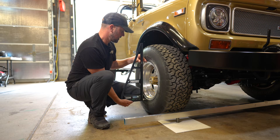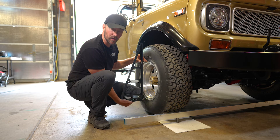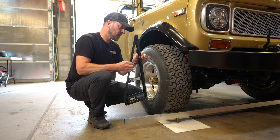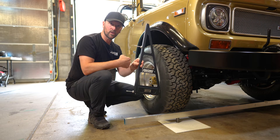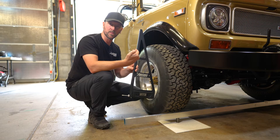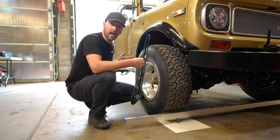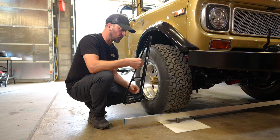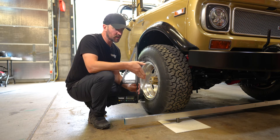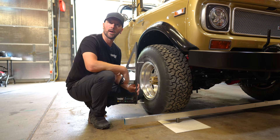You'll come over here, put the gauge on the wheel, and now you're reading your camber off that new alternate plane. You'll do this on the other front wheel because you already have your bar set up here. You'll press alt zero, take your measurement there, and then repeat the whole process at the back axle doing both wheels back there. By doing this, you're going to be able to accurately set your camber on any surface, no matter where you're at.